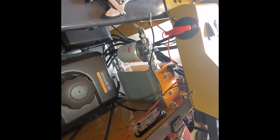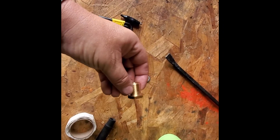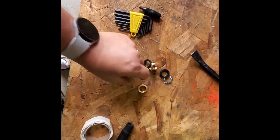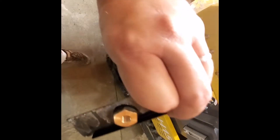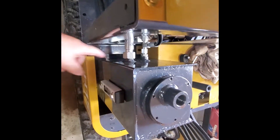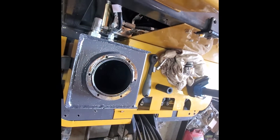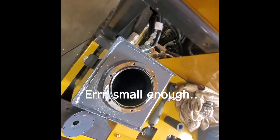Now that we have our wiring done for the fan, we're left with the last piece — getting that hydraulic temperature sensor in there. What I've decided to do is drill a hole in the side of the hydraulic tank and put one of these bulkhead fittings in. It looks like this: you put an O-ring on it, then one of these tooth washers, and put that on the inside, so you end up with a 1/8 NPT hole to screw in the sensor. I was really concerned about how to hold the nut on the inside, but when I pulled this apart I noticed the top piece comes out and my hands are big enough to get in there and hold a wrench to make it oil-tight.